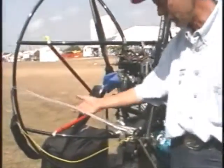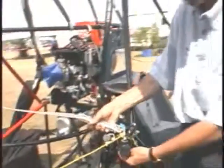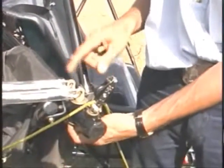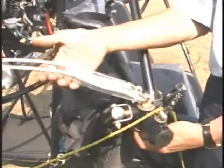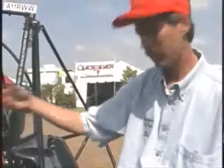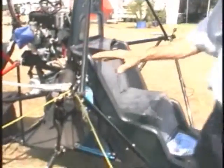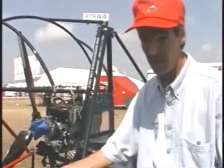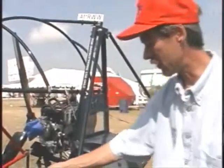When it comes to the cabling system, I'm very picky. I make sure we have AN45 eye bolts — this is standard in the industry. I don't want any hardware store hardware on this; this is my lifeline. I check the cables, I check the swages, and I check for wear on the cables or possibly a prop strike, then follow that back to the parachute. I'm very concerned that the hardware hasn't been replaced and that the same types of cables are used. A lot of guys, if they damage a cable, will go to a hardware store and replace it themselves, and I don't trust a lot of people's swaging.